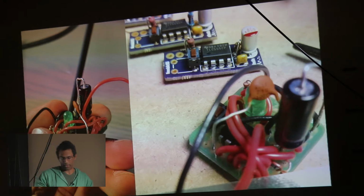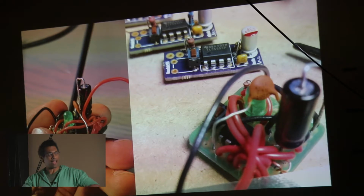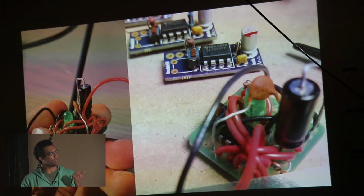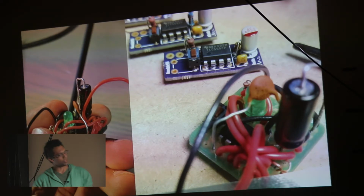And then I took it a step further. Rather than just putting this wonderful bit of wiring into the box and being like, that probably will work forever, I jumped into KiCad and with a bit of help from Metal learned how to actually make a little circuit board, and got that put together and figured out that this is a second revision actually. The first one, I didn't break out the right pins, so the circuit worked, but you couldn't pull anything out of it. And this one allows you to press the button, have the power running through it, and then take a data pin out, and it stays on for however long you put a resistor on there.